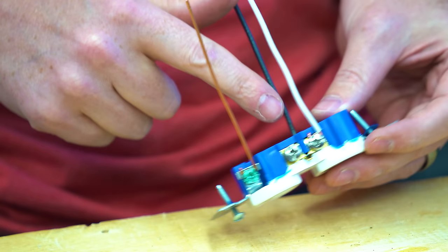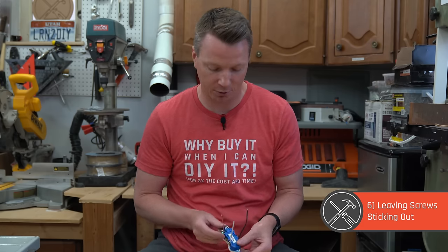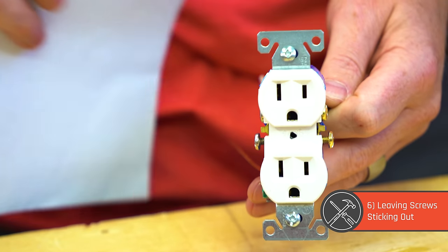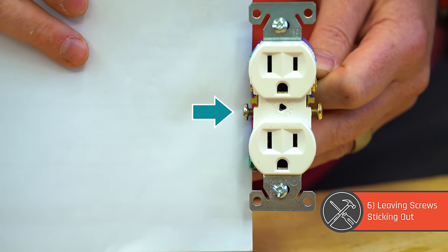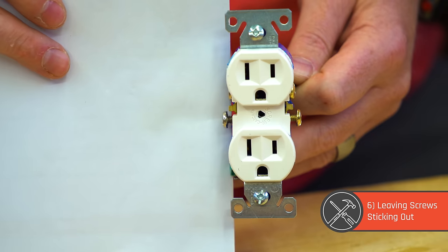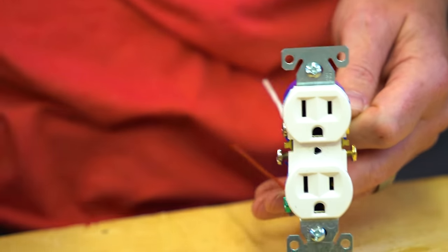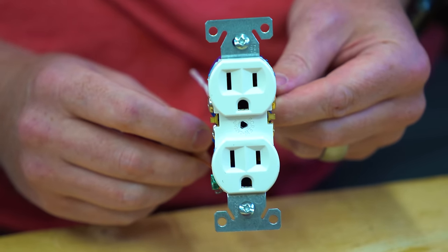For number six: let's say you've done everything right — beautiful shepherd's hooks, great contact, right amount of wire, right screwdriver. There's one thing that often gets overlooked, and one I've definitely been guilty of: not tightening down the unused screws. If you look at the profile, a loose unused screw sticks out further than everything else and could touch an adjacent outlet, a metal junction box, or a bare ground wire in the box. To reduce the likelihood of any issues, just tighten it down. Now it's flush and much less likely to cause problems. I'm Nils with Learn to DIY — thanks for watching.